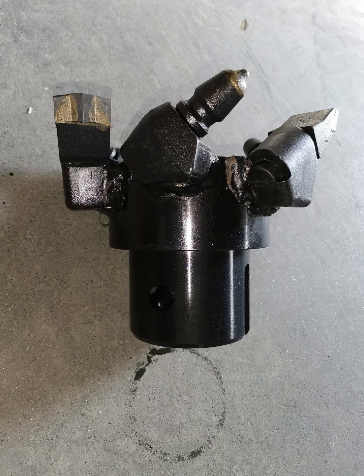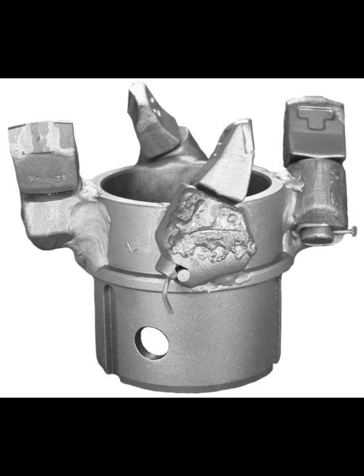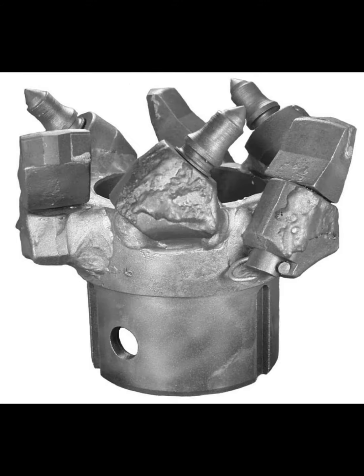This method is best suited in soils that have a tendency to collapse when disturbed. Bottom plugs can be used where no soil sampling is conducted during the hollow auger drilling process.